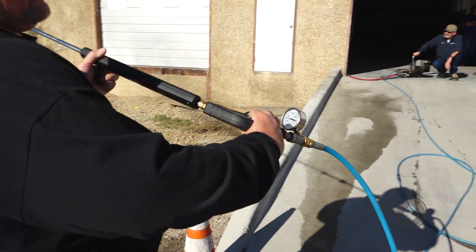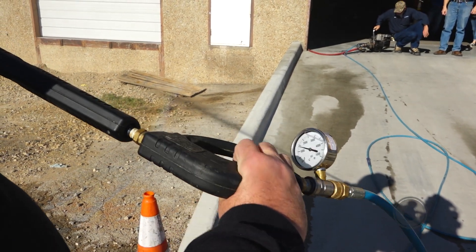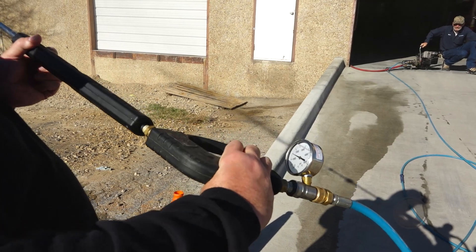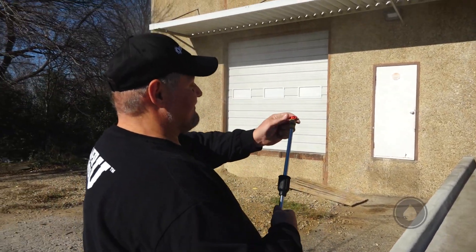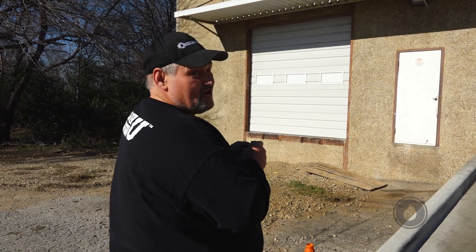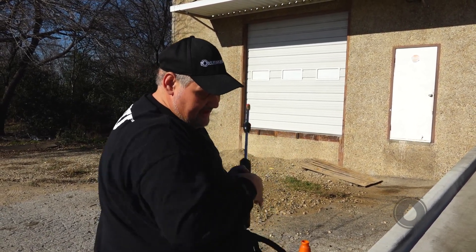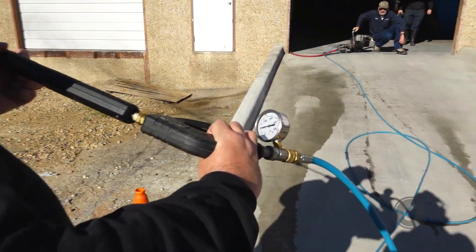You can see it's running a little bit more than 1500 PSI. I'm going to let it go — it's going to spike up to 2000. That's the unloader working. Now that's a 5 nozzle. I'm going to put a 7.5 nozzle in here and show you the pressure drop — not touching anything but the nozzle. Look at that, we're down to a thousand PSI now.